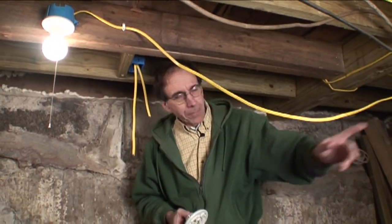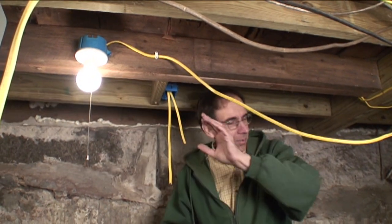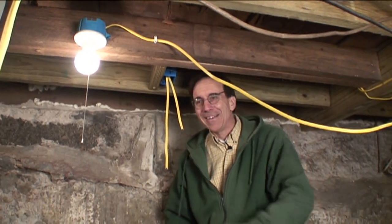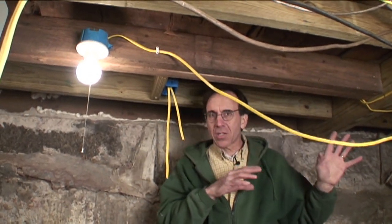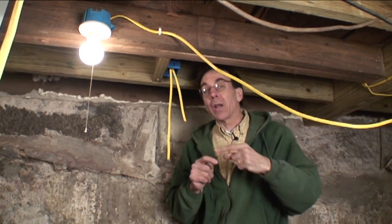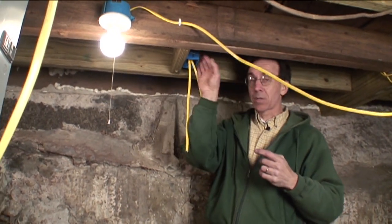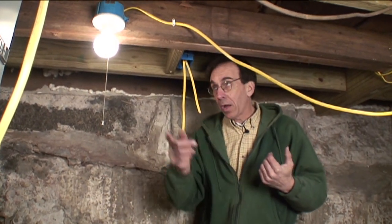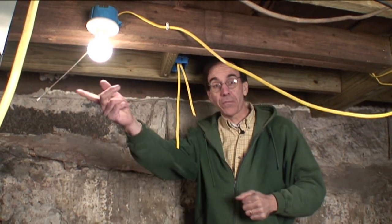That will mount up here on this box, we'll put a light bulb in it, and when we get power over to that panel, we will then have the luxury of taking this out. A lot of this wiring is tied in with other circuits in the house — if you shut off a breaker for one thing, all the basement lights go out. Now we're going to have a dedicated circuit. We're also going to do another round of wiring in the basement for outlets that will be live all the time, spread around the basement. The idea is we don't want to use any more extension cords than we need to.